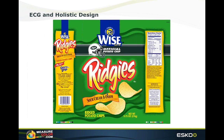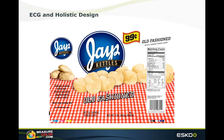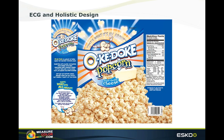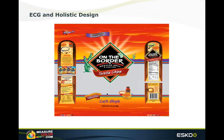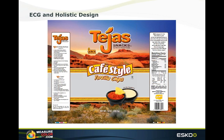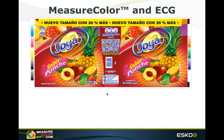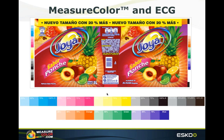And so 7-color process gives us better economics, and it gives us the ability to make better looking packaging. And if not the ability to match an exact Pantone color quite as good as spot color, it gives us the ability to get greater repeatability and greater consistency if you couple it with a system like MeasureColor to enable you to control those spot colors and control those 7 colors on press. And with that, I'll hand it back to Dan, and he can just say a couple more words. I think we have a slide or two here that allow him to connect the MeasureColor concept to the expanded gamut concept.